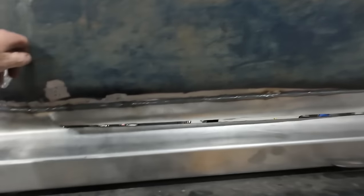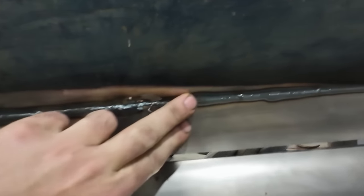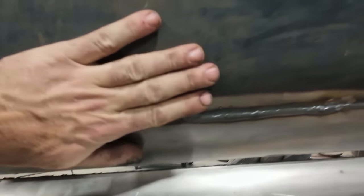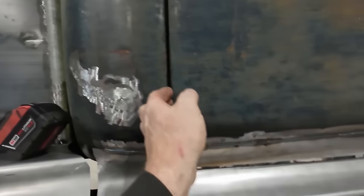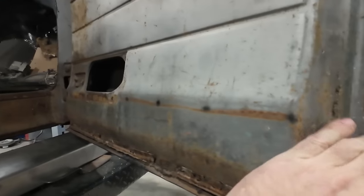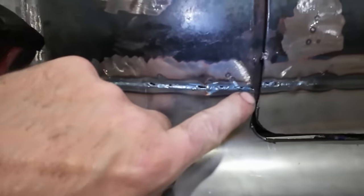So how does it work? Well, it works awesome. For what I wanted to do with it, it works awesome. It's sheet metal. You can see the heat soak is like next to nothing. Very minor. I am getting, that's what I was spending time playing with. You can see inside the penetration's actually poking through like a really nice MIG or TIG weld. So that part's good.